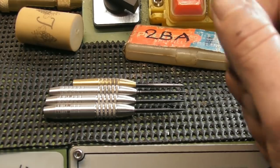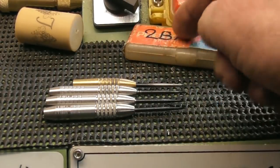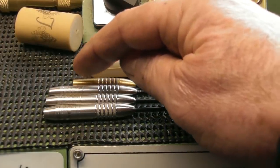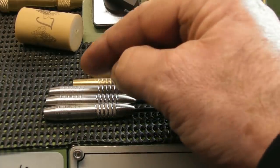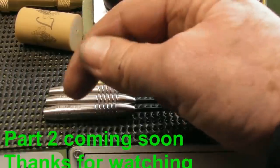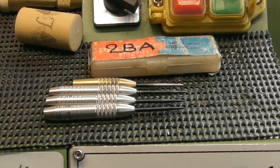I haven't got a 2BA die, otherwise I'd make up a little mandrel for the chuck, turned in situ, that would screw on. But I've only got 2BA taps, not a die. However, I have got an aluminium dart shaft — they're pretty tough even though they're anodized — which I could hold up in the four-jaw, clock it up to get it perfect. So the next setup will be: part them off to length, turn the tapers, and then finish off tapping. I think that'll be it, so that's all to come in Part 2.